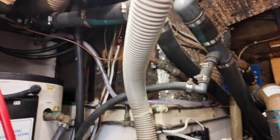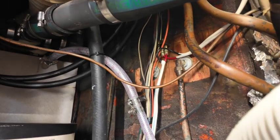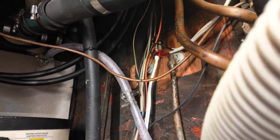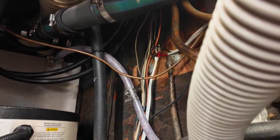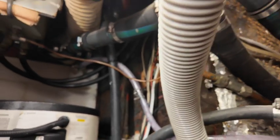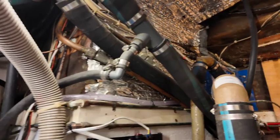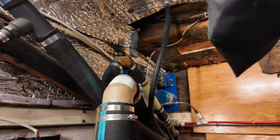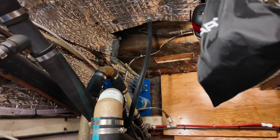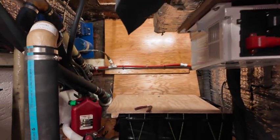I wanted to keep that hose away from the stainless steel hose clamps against the copper pipe, because I believe stainless steel against copper will start to corrode the copper. In electrical work we also always keep our MC cable away from copper pipe for corrosion purposes. So I zip-tied it to that tube — all zip-tied up and strapped. Looking good; ready to install the electrical.